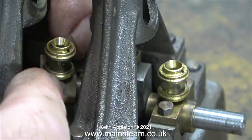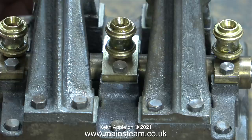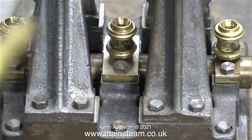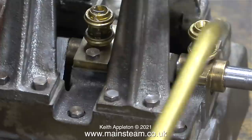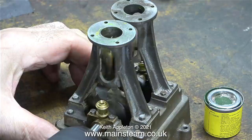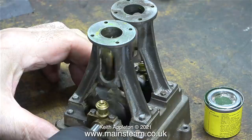After a very light oiling of the moving parts, I thought now would be a good time to fit the lubricators. These are three of the modified ones that I originally fitted to the triple expansion engine. They're very easy to fill with oil and they hold a lot of oil, which is very good for the crankshaft bearings. I've been very careful not to get any oil on the cast iron parts that I'm going to paint. I thought I would rotate the engine with my electric drill just to see how it feels - and to be honest it feels really well, it's hardly worn, and this part of the engine is very well made indeed.